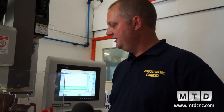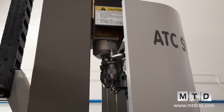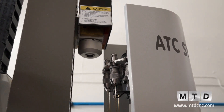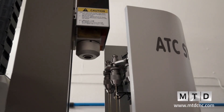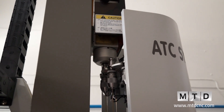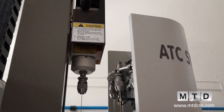The capacity is 600 by 400 in X and Y, and the Z is 400 under the nose. The tool changer on this particular model has 12 positions. It can hold different size electrodes, though in this case we're only holding the same size because it hasn't got an auto guide change — every tube needs its own guide to keep the stability and the accuracy.